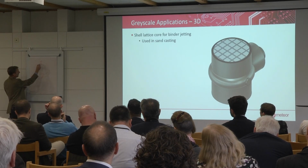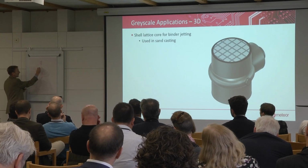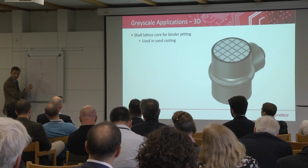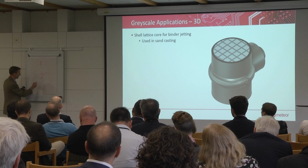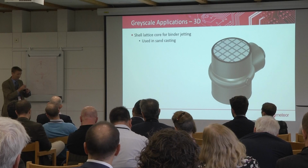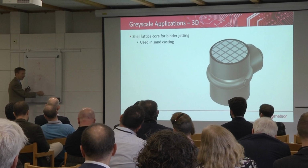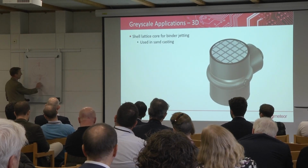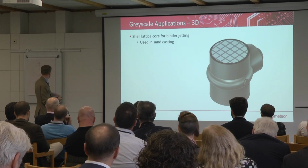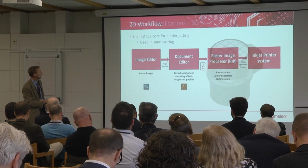And we realise that the resolution of a print head here and the resolution of a print head there are different because of the different distances to the centre. And that was completely analogous to printing on cups and bottles, conical cups and bottles. The same challenge. The print head sitting here, the resolution here is different from the resolution here. So solving, again, the 2D, it looks like a 3D challenge, but a 2D printing on the outside of a 3D object, the software which we use for that, we could convert into software which a 3D printer needed to be able to print on their continuously layer building structure. I may have explained that too quickly, sorry.